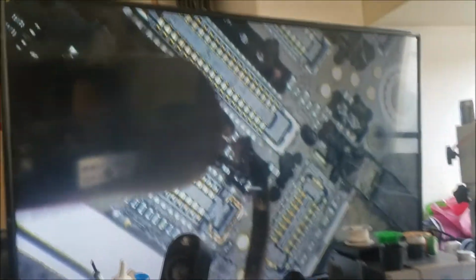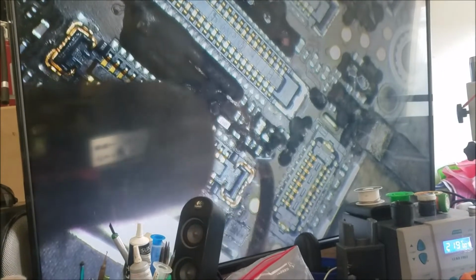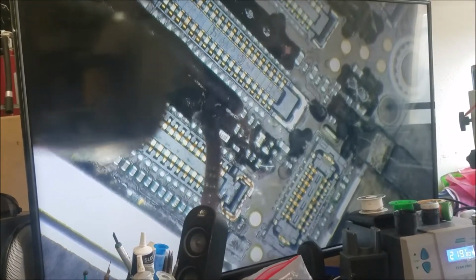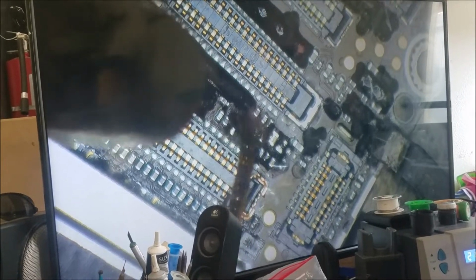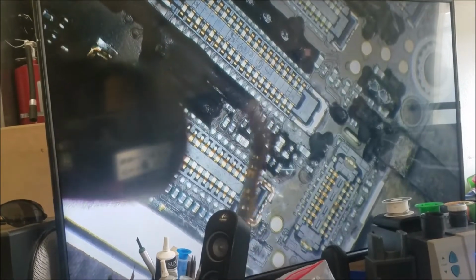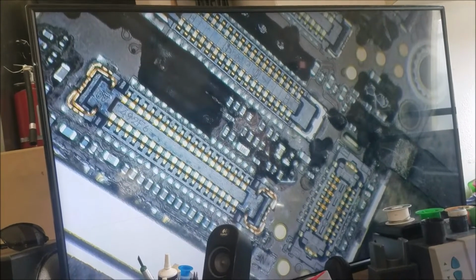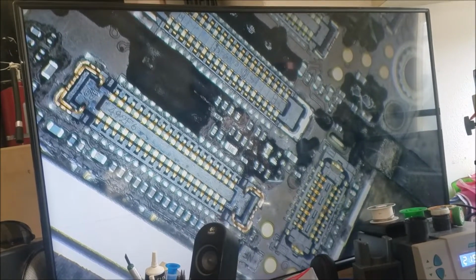Cleaning here will save you a lot of time, because if one of these components moves while you are removing the chip, it's going to be hard to put it back and to check which one is causing the problem. So do some work now, save your time later. This job takes about 5 minutes. So I'm just going to clean this area. This was close to the chip. I don't need to do the other ones. I already did this one. We'll finish some here and here. And this should be good to go.